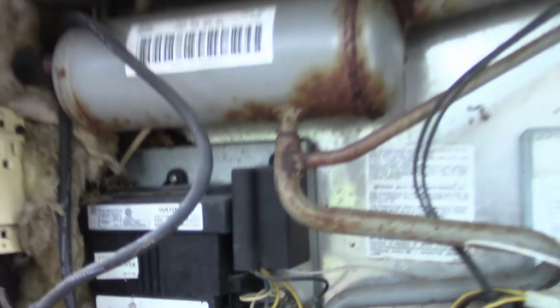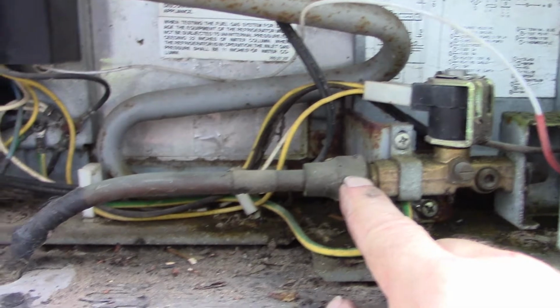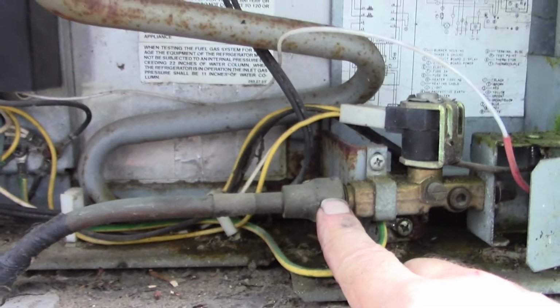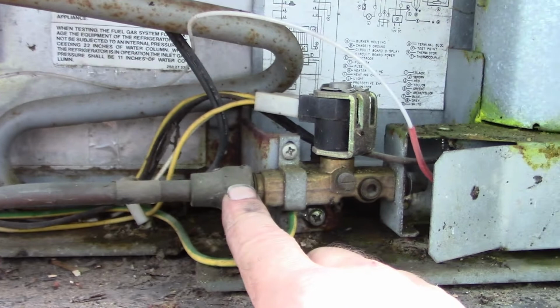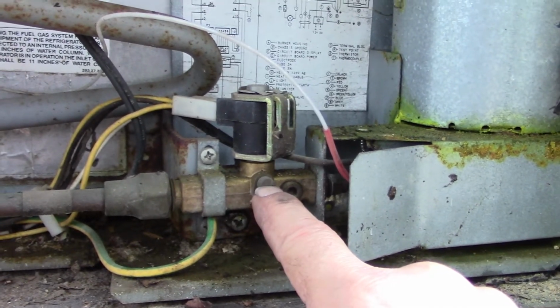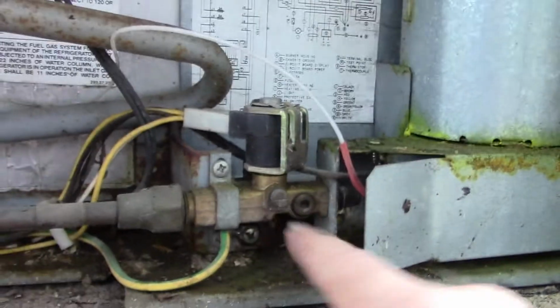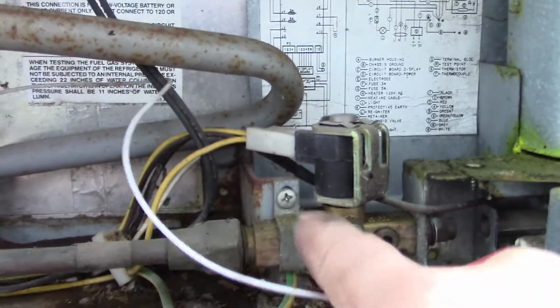First and foremost, unplug the electric. And another thing we have to do is disconnect the LP gas line. Now, I don't have any disconnects other than the shut-off at the tank. So I'm going to have to figure out a way to plug this up since we won't be reusing it. For now, what I'm thinking, it's got this 12-volt valve that's automatic, and I think it would default to the shut-off position. So if I can leave that on there, that would probably allow us to disconnect this. Now let me see what I could do here.